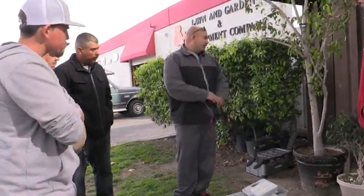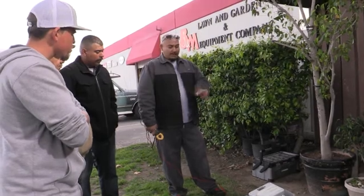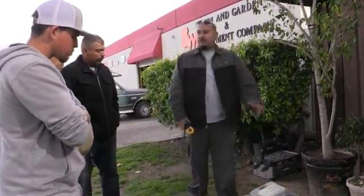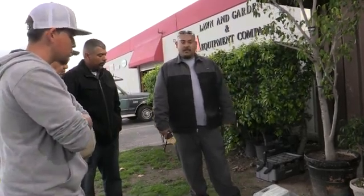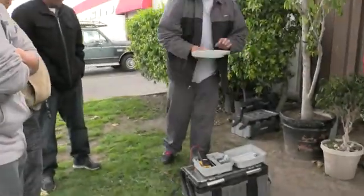We have it in the books — we'll go over them later step by step, how to diagnose and troubleshoot the system. So the first thing you want to do is come to the clock. Is it on or off? Most clocks will have a battery backed up, like a 9-volt. So the display might be on from the battery supply, but it might not have 110V power to the timer. On the Hunter or Rain Bird rain dials, you can have a 9-volt battery, go sit down on your couch and program the clock without having to be at the timer. If a homeowner just doesn't want to stand there, they can take it off, program the time and schedule, then go back and plug it in.